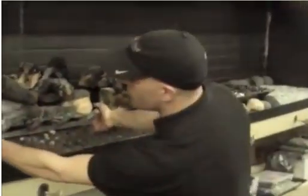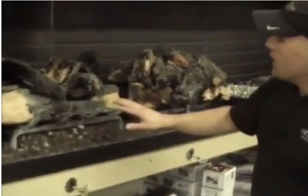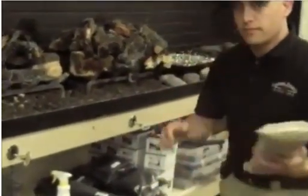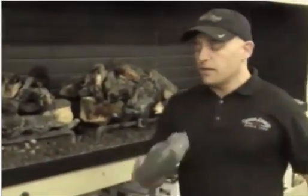The next thing you need to do is remove all the sand in your sand pan burner, which is underneath the grate. There's a burner here. There's a pan with a tube in it. You need to take all this out, and then in the sand pan burner on the bottom, you put in new sand. And then over the sand, and only over the sand, you put some new ember material.